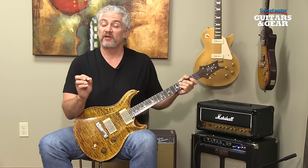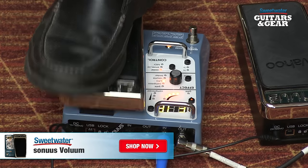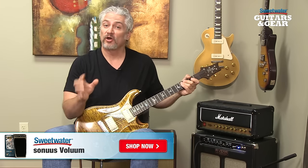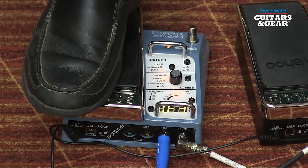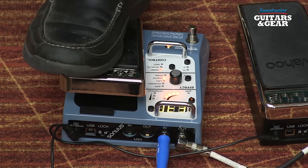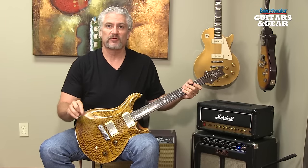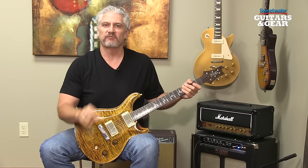The LFO is very versatile with different waveforms that you can use for shaping the tremolo effect. We can also use the pedal to create auto-fade in and auto-fade out — when the pedal's back we're fading out, when the pedal's forward we're fading in. So there are lots of different volume-based effects you can create using Volume, with a lot of access to parameters if you want to get in there and really dig deep into the editing. You can do that under control of MIDI, via USB, or it's very easy to edit from the front panel as well.